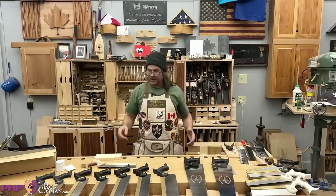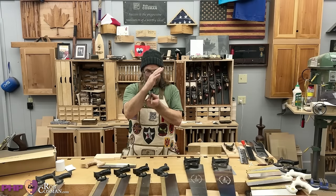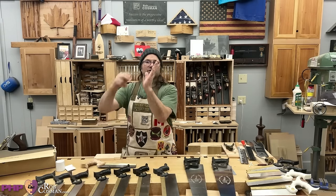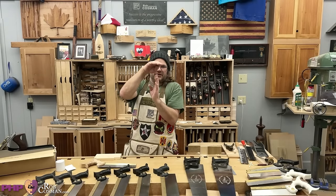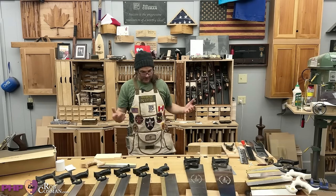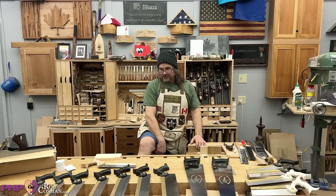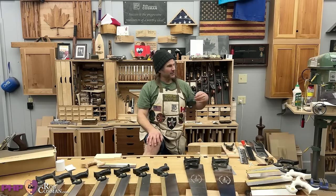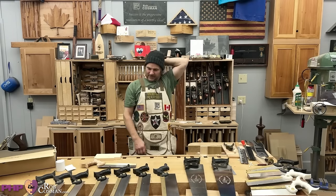But you're right. Every time, you've got to remember that that tooth is bent from the base of it out. So every time you sharpen, you're going to take some more off of this, more off of this, more off. And eventually you're going to get right back into here where there's no set on at all. But I tell people if you're dovetailing on the weekends, three times a month, you might get 3 years between sharpening, so you don't need to sharpen it as often as I think some people would assume. It's not like a plane blade or a chisel.